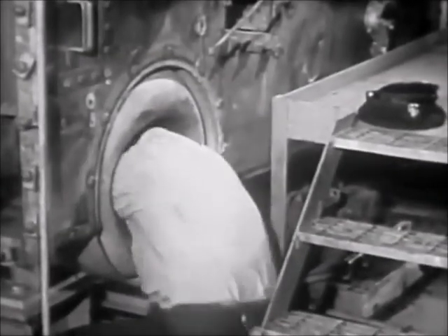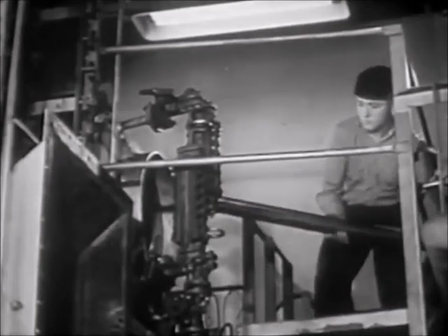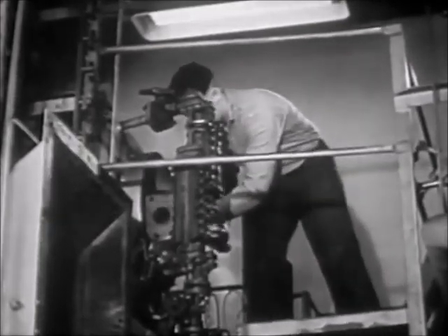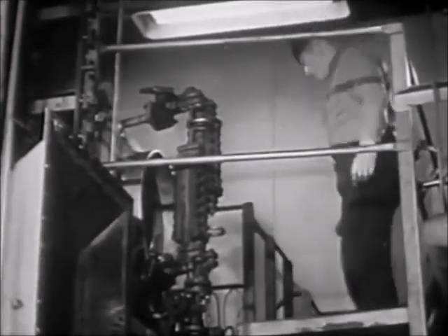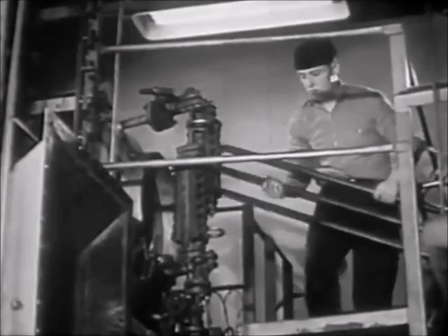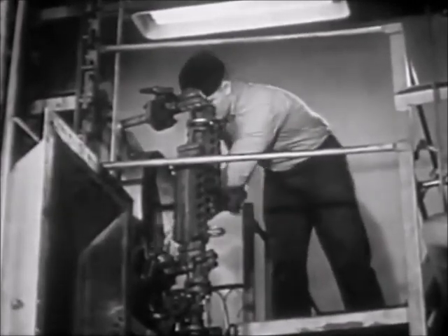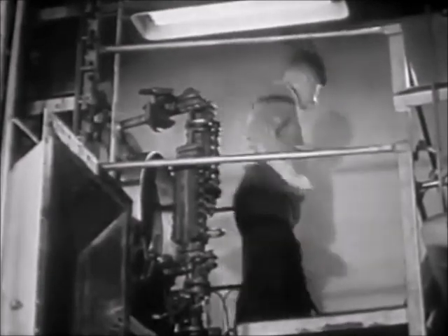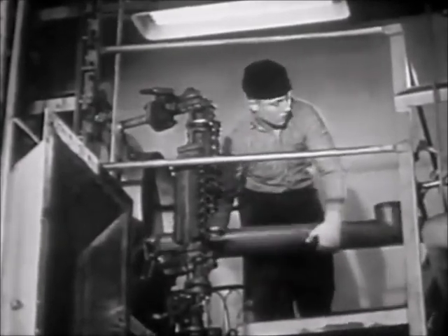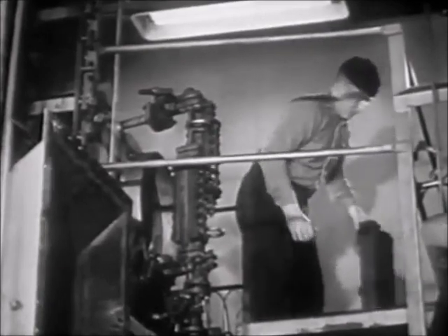Inspect all drums and headers for loose gear, and be sure they are clear of personnel. All the internal steam drum fittings must be reinstalled: first, the internal feed pipe, then the de-superheater, next the dry pipe, and finally the steam baffles.